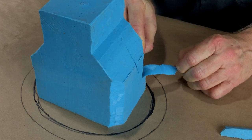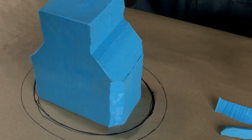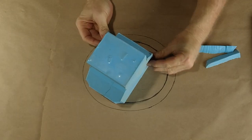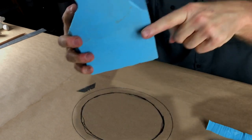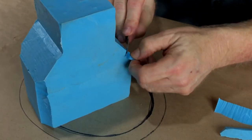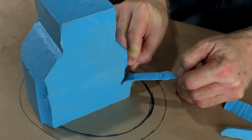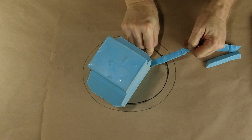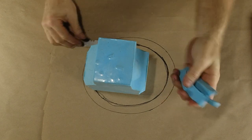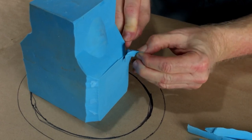And it's going to serve another benefit too, by the way. It's going to allow a little bit more even distribution of pressure of the rubber bands. I won't have this corner for the rubber band. You know, when the rubber comes around these corners, it deforms the mold. It's not good. I like round molds. As you have seen me do many times, I generally build rounds into my molds, and that's in effect what I'm doing here. Trouble with a round mold is if it doesn't fit the shape of your model, you wind up wasting a ton of rubber. And you all know this stuff is gold. It's expensive. We don't want to waste it. So first things first, let's get these things cut down.